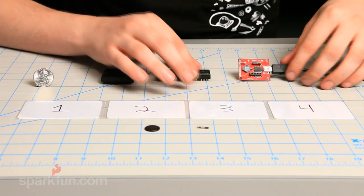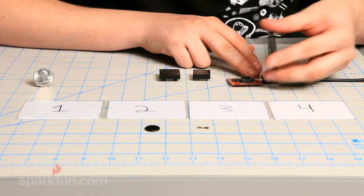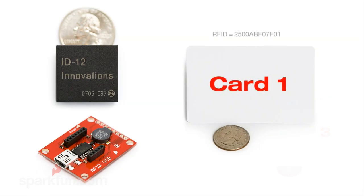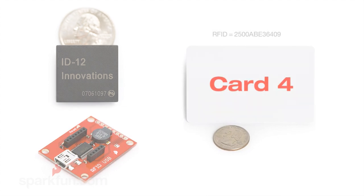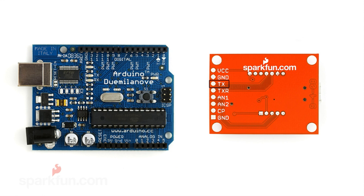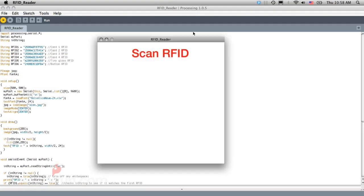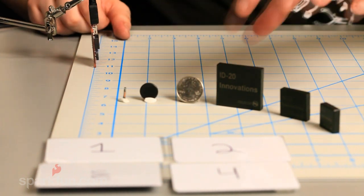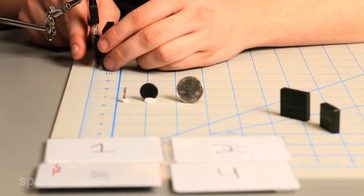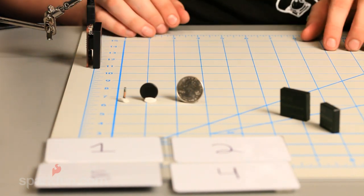Let's show you how easy this is to do. We'll start with the ID20 — this is the biggest and baddest of the three. It just plugs right into the headers on the RFID USB board. The RFID transmits a 12-digit identification number over the TX line, readable from any terminal program or the Arduino serial monitor. We'll start our sketch in Processing to show us what we're actually scanning. We have it on a grid so you can see a real-world display of distance.